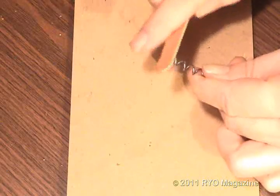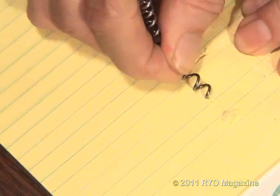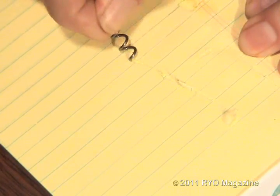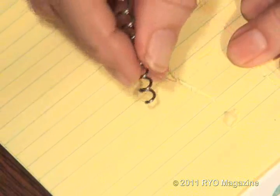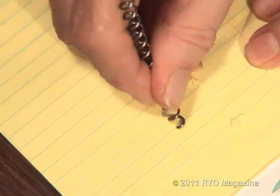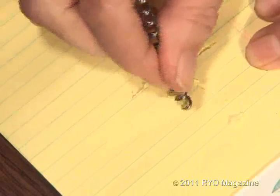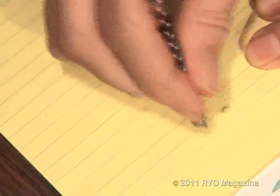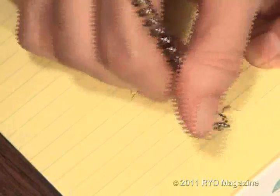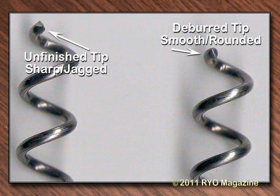This improvement is most especially notable with the low speed motor setting of the Easy Roller driving the auger. This next demonstration on a paper notepad is quite revealing, with the original rough auger easily tearing the paper with almost no force applied. After the auger has been properly smoothed out, it is hard to even make an impression on the paper. This translates to a great deal less stress on the tobacco strands and ultimately a stick that will hold tobacco far more efficiently. Please note that the latest versions of the Easy Roller already have smooth finished augers from the factory, but this technique will work both on older Easy Roller augers as well as any other auger machine.